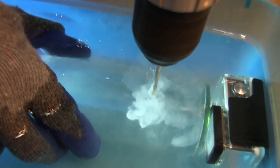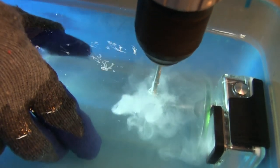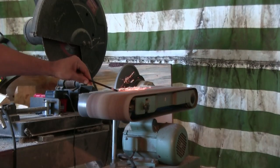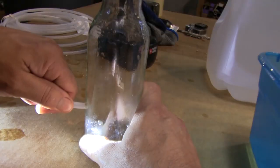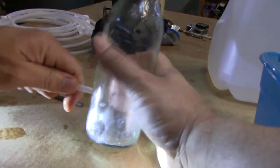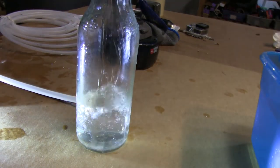Occasionally, reversing the drill prevents the bit from getting wedged and shattering the bottle. I'm tapering a rusty rasp designed for sharpening chainsaws. Any round rasp will work and may be required to slightly enlarge the hole for the polytubing to fit into. Filling the bottle with water will instantly reveal any leaks.